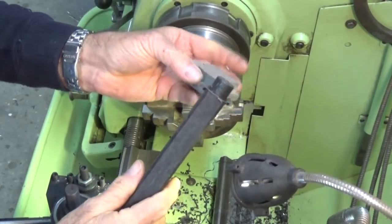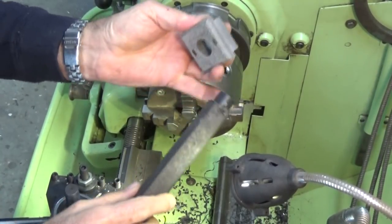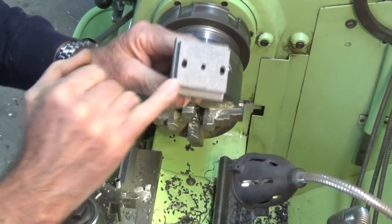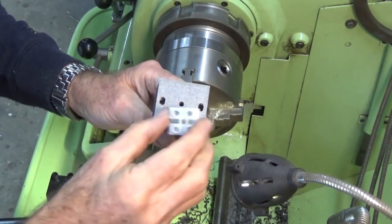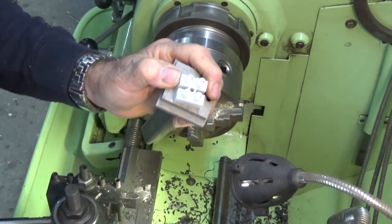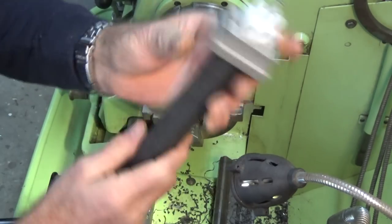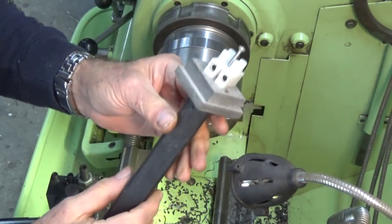Well, this is how that assembly goes. So the turned end on the peg will fit into that circular hole in the bottom of this eco deck plate here. Terminal block will sit on top of that, and there'll be a single stainless steel self-tapping screw that will hold everything else together.